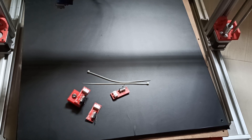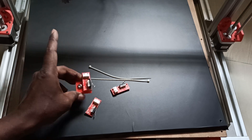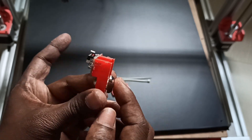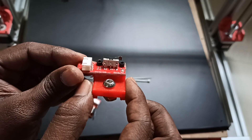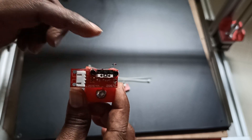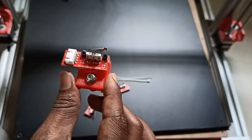Now we'll install the end stop for all three axes. First, we install for the Z-axis. This one I'm going to use for Z-axis — it has a T-nut so I can install it on 3030 aluminum extrusions. It will come and hit so that this switch will be activated. Let's see that first, then we will install the other axes.